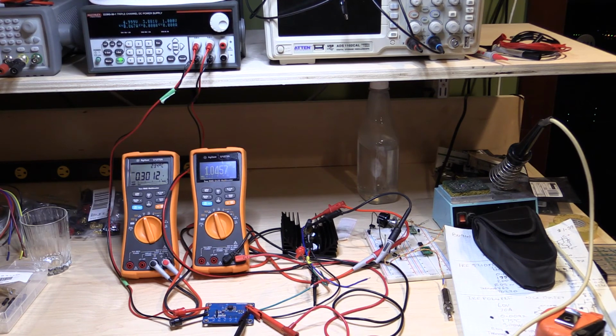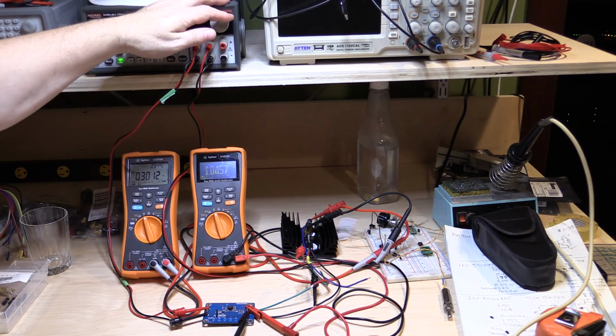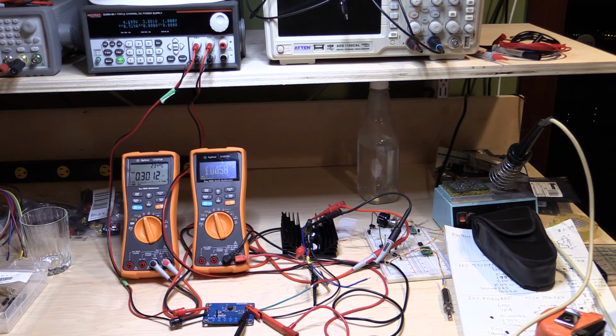and the current is remaining the same, 1.045 volts on the output. Now I'm going to change the resolution of my step down here because I want to bring it down now. So this is 5 volts, so 4.7, theoretically it should start collapsing on the output. So that's 4.7 now, and I don't know if you can see that, but it's still sitting nicely at 1.045 on the output. So it still is quite happily kicking out the 3 amps, 3.013 amps, and that's 4.7 volts. Now the one thing you will notice though is that the input amps now has gone up to 929 milliamps.